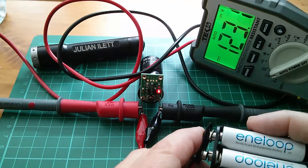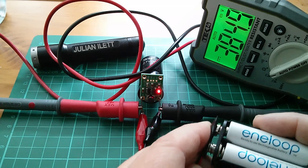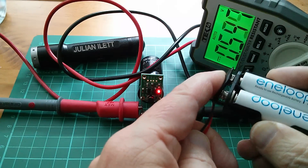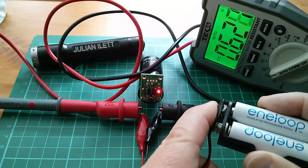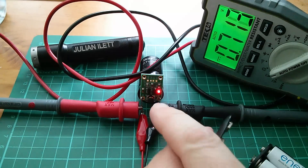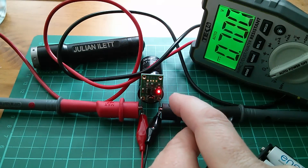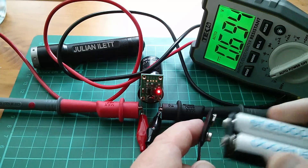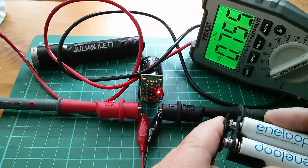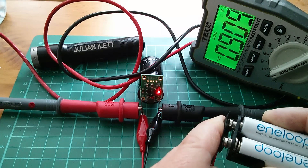This is a 2.7 volt capacitor, so let's charge it to something a good bit higher. The wires are getting quite warm now — in fact quite hot, not meltdown hot, but significant. We've got 0.7 volts now. That's easily enough to keep the LED lit — there's probably the full 5 volts on the boost converter output with 0.7 volts going in. Let's take it further — 0.8 volts, let's take it to over a volt.